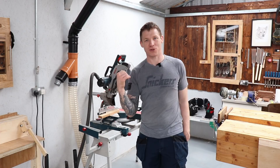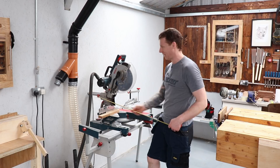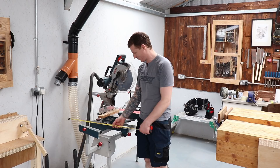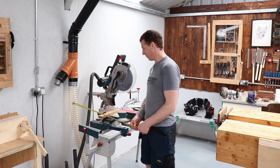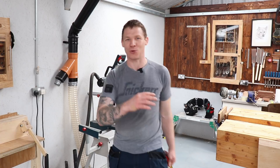The first issue is the miter saw itself - this is the Bosch GCM 12 SDE and it's a pretty massive miter saw. It needs a lot of room at the back and around it. A standard worktop would be 600mm or two feet out, but I'm going to have to keep this section out roughly 700mm or 28 inches. I also have to incorporate this cowl into the back of the unit - I have an idea, not quite a plan, so this will evolve as we go.